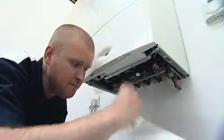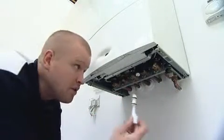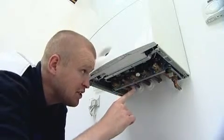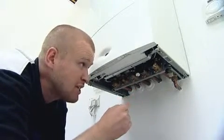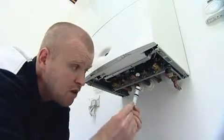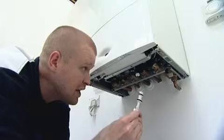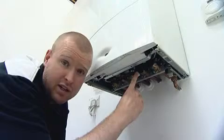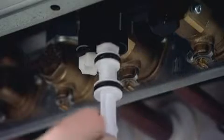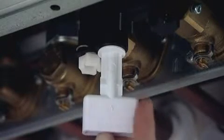I'm then going to remove the key. Now I need to insert the key up into this black plastic manifold. This filling manifold is actually linked from your cold mains into the boiler through to your central heating return. What I want to do is fit the key up inside of this hole with one of the white arrows on the shaft of the key pointing at the open padlock position. There are actually two symbols — one of an open padlock and one of a closed padlock. So I insert that key up into the black plastic manifold with the arrow in line with the open padlock position, then turn the key to the closed padlock position.